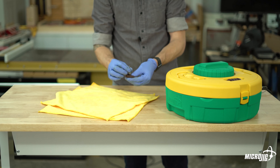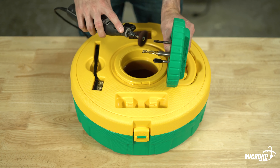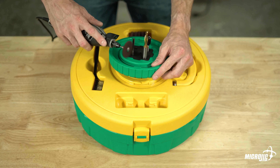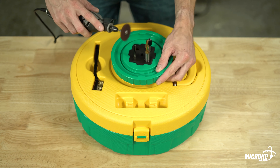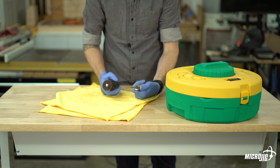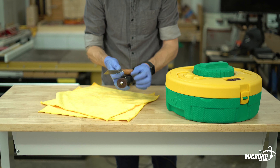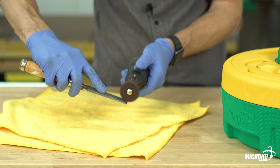Insert the included mandrel into your rotary tool or electric drill. Set it to between 8,000 and 12,000 RPM and gently go over the cutting edges of the bit to remove pitch. When using the edge of the scouring disc to get into tight spaces, run the edge along the cutting edge, not perpendicular to it. These discs are sharp — having the disc rotate into the sharp cutting edge will wear it out quickly and the friction could actually dull your bit. So if your tool spins in a given direction, always move away from the cutting edge, not into it.